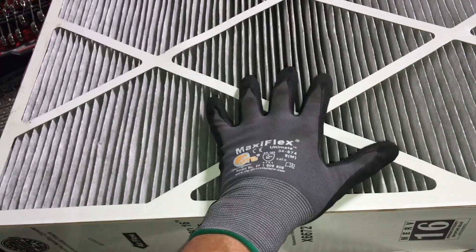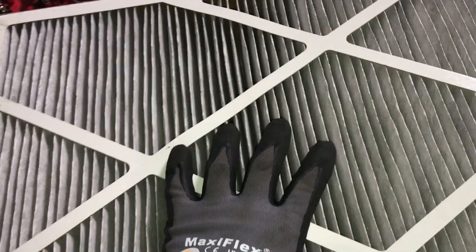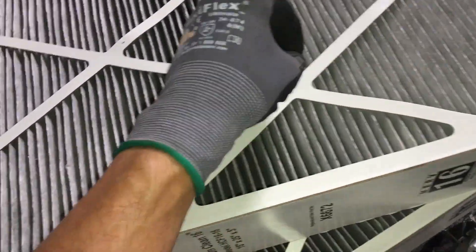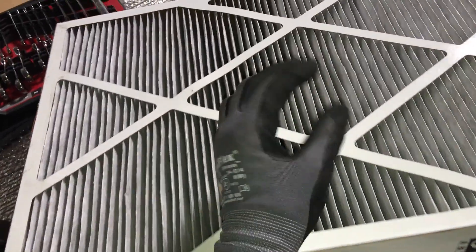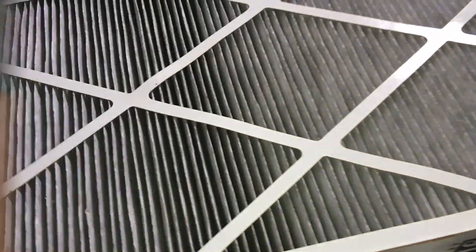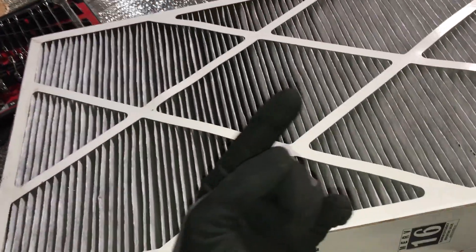But here's something that fools a lot of technicians: when there's a place that sprays a disinfectant, anti-microbial, anti-fungicide, anti-bactericide, or anything to control bugs, they usually use surfactants. A surfactant — I'll get to the right word — is something you add to water so the water will literally grab onto a surface and hold, rather than rolling right off. A surfactant is often a soap or oil.